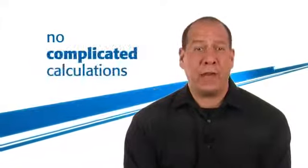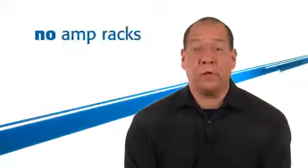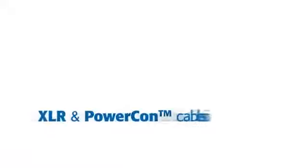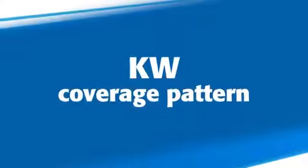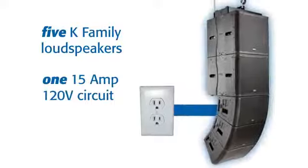Being a fixed arcuate line array, there is no need for complicated calculations to figure out box-to-box display angles. And since KLA is powered, there are no amp racks to configure or signal processing to adjust. The KLA-12 is housed in an impact-resistant ABS enclosure and can be used with or without the companion KLA-181 flyable subwoofer. To get you right out of the gate with your new system, both XLR and PowerCon jumper cables are included. And speaking of electrical power, the K-family power module is so efficient that up to 5 loudspeakers can be operated on a single 15-amp, 120-volt AC circuit.